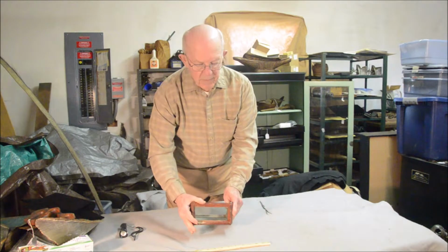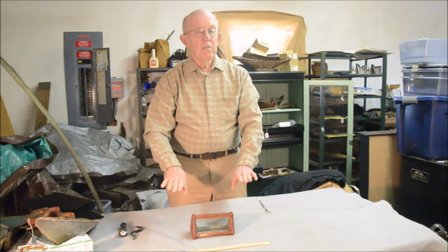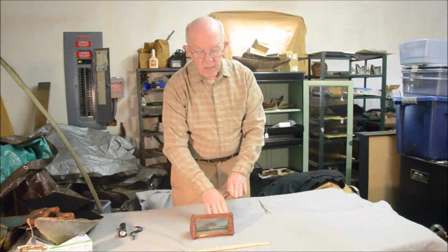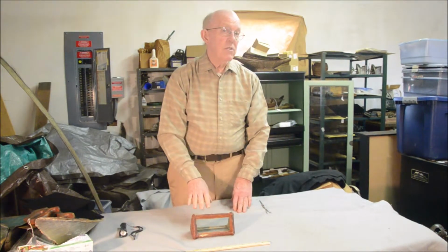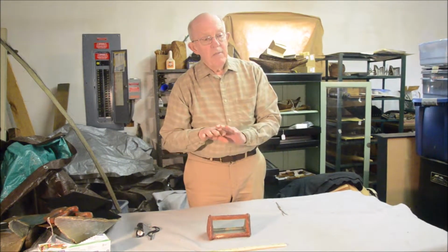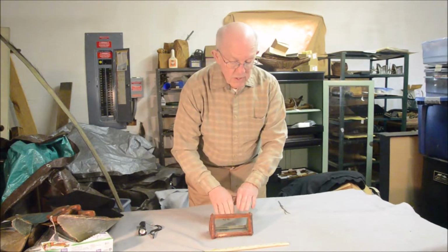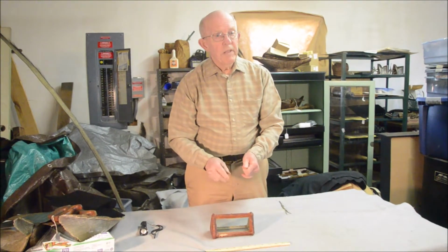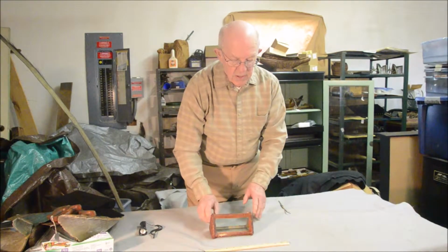The nice part about a liquid like mercury is that when you put it in here, it spreads itself out in a completely level sheet. It doesn't accumulate in one place or another, and so it's equidistant from the bottom on all edges. You can do that with molasses too. It'll spread out like that and still be reflective. But the nice part about using mercury or molasses is that they will sit flat. They won't tremor. They won't get too many little waves in them, and that allows you to visualize the sun through this.